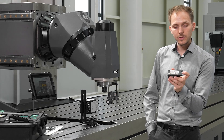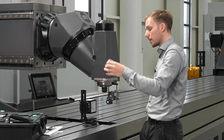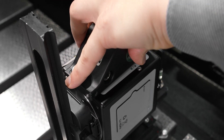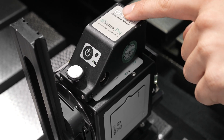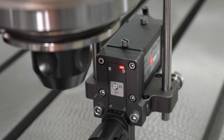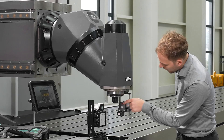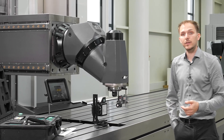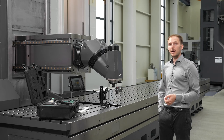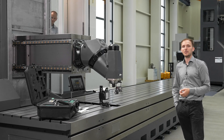This screw fits into a little hole on top of our T430 laser, so when you put the D140 on, it is fixed and you can only move that one screw for alignment — very practical. The laser beam of the D140 will be here, and we use the R540 as our target for this measurement. Now I have my colleague Bernd Koszynski with me to assist by moving the machine.